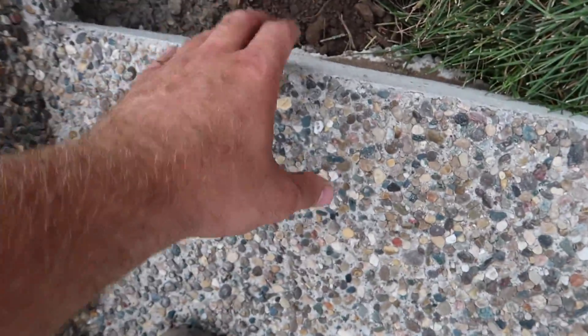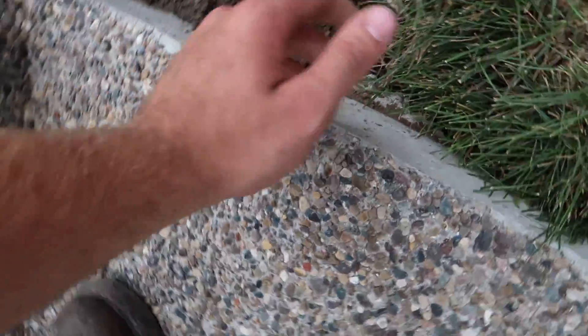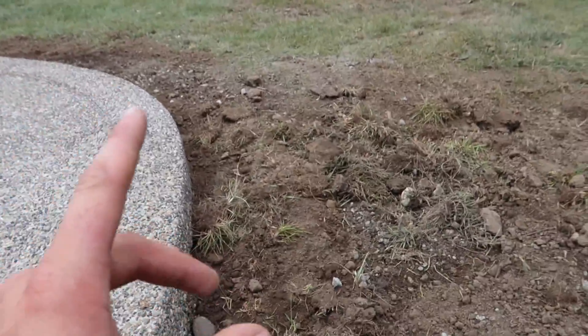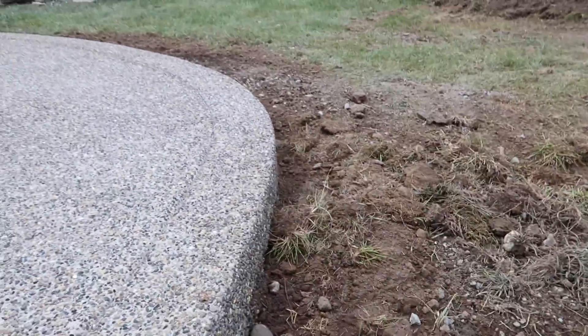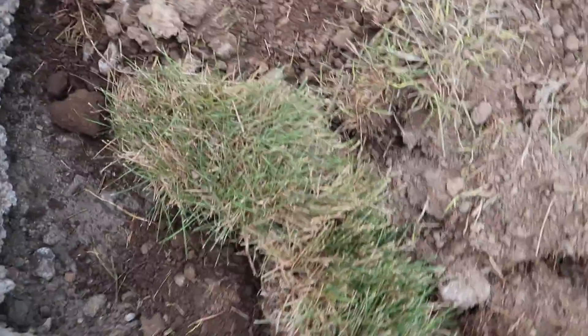Plus, we put fiber in it too. What you do is you pour it and then you put a retarder on top after you pour it. And then that retarder peels the top — see right here? So this is a face. We didn't need to power wash it off because it's covered with grass. By the way, update: they are redoing their landscaping, so they told us not to worry about putting topsoil down here. That's nice for us because it means we could tear it up a little more and not worry too much.